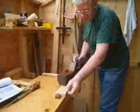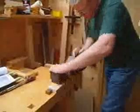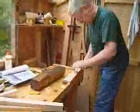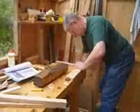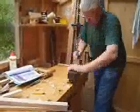Now, take this and press this down a bit more. So this end vise gives you a bit more control. Very useful thing when you're doing beading and jobs like that. This end, and then I'll test it and see how I'm doing for thickness. 18 mils is what I'm aiming for, according to this, and I'm not far off it now.